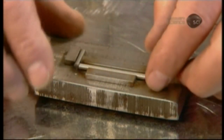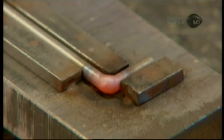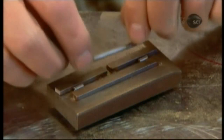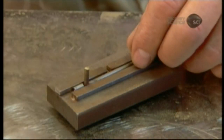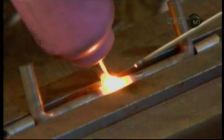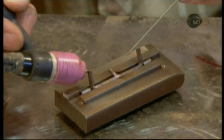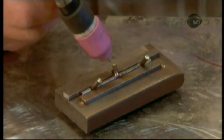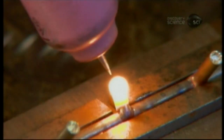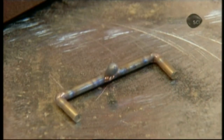The buckle maker welds small stainless steel rods together to form the back of the buckle. After placing them in a welding fixture, he precision welds them. Using another fixture, the buckle maker adds a center pin to the back of the buckle. After precision welding it into place, he melts the tip of the stainless steel pin into a smooth ball. This locating pin centers the belt in the buckle.